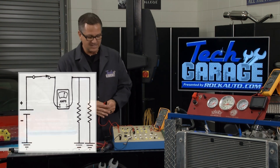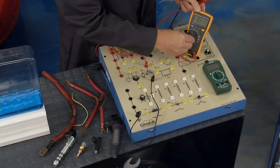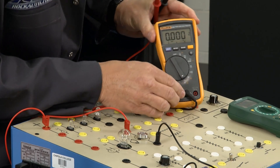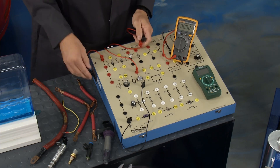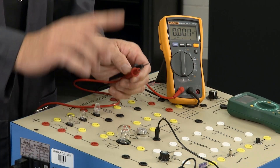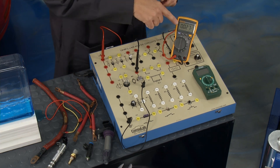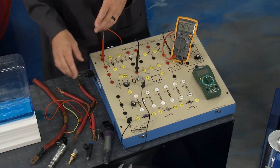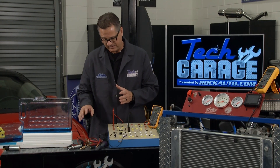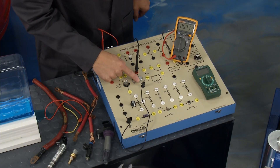To measure amps you need to shunt the meter. Switch it to amps and move the positive lead to the amps input side — we're going to run the electrons through the actual meter. I switch it over to amps and I've got this motor running. I disconnect the circuit going to it and in series I hook up this amp meter. The motor's running and the electrons are running through the meter counting them. There are two types of resistance: electrical resistance in wires — bad wiring creates heat and that's a problem — and mechanical resistance.